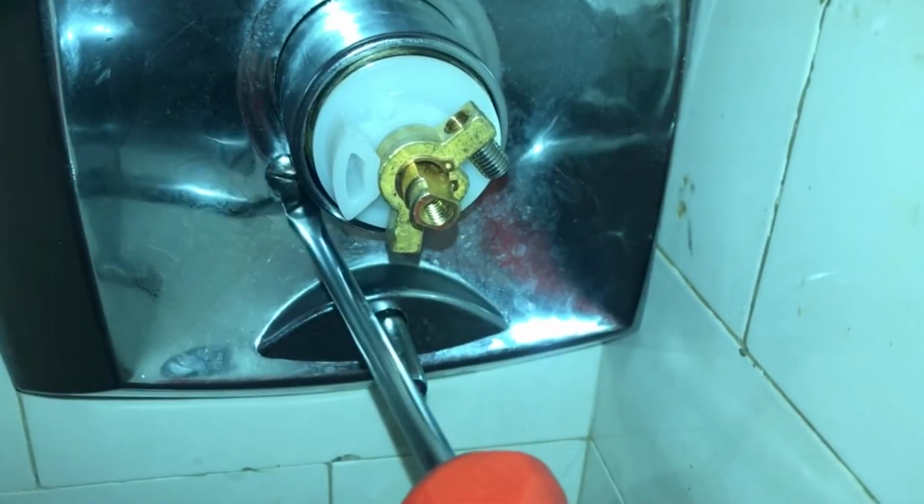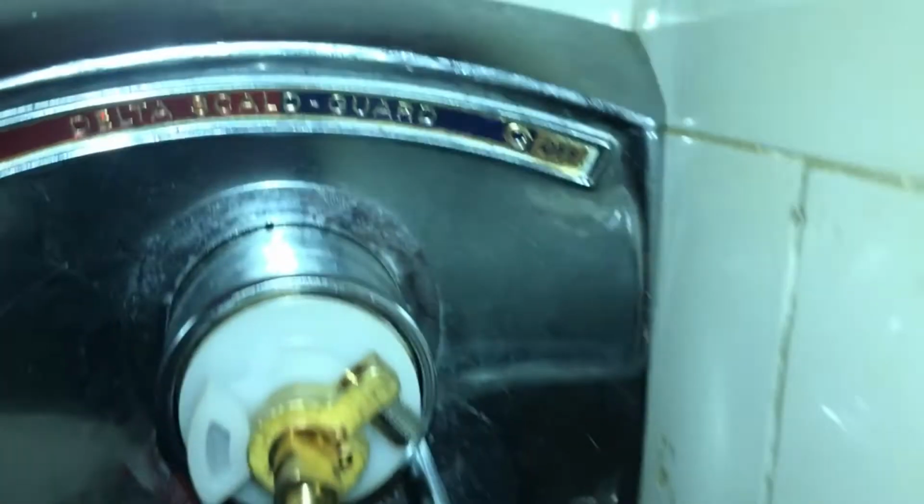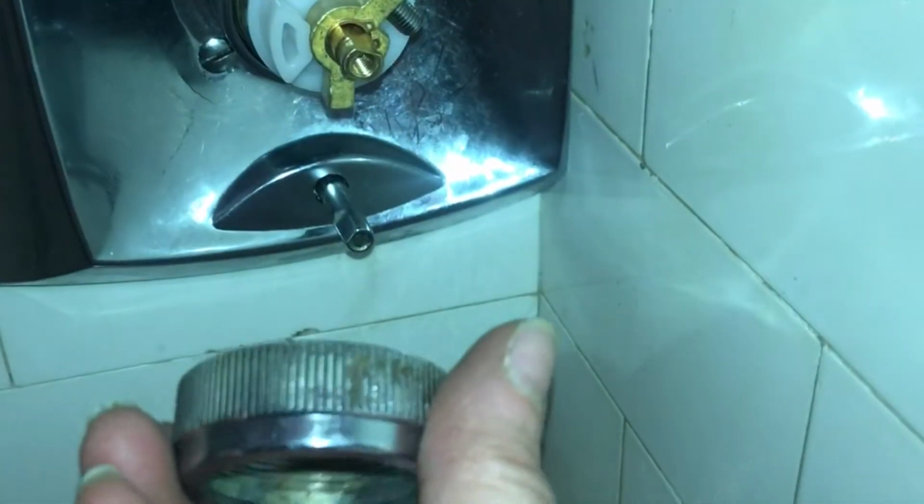So we've got our metal ring on the escutcheon plate, and now I'm just tightening up these screws. There are little holes in the brass part that these run through. That can be very tricky. We're fortunate to have an access panel in the back, and I actually just have my son hold it while I tightened it. And our next piece that goes on is this ring. We're only going to hand tighten this. We're going to make sure everything is going to slide up in there, and press that on. It's going to tighten everything.